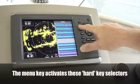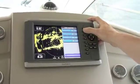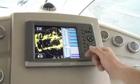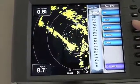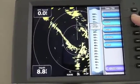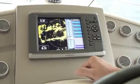The next settings we're going to be looking at are the clutter controls — more specifically the sea and the rain clutter. Sea clutter is the returns that you get from waves in the boat's immediate vicinity, and will often obliterate the area around your boat on the radar screen. This Garmin radar comes with three settings: calm, medium and rough, but it also allows you to go up and down by 5% at a time, until you lose all of the returns that are obliterating any possible targets that are close by.